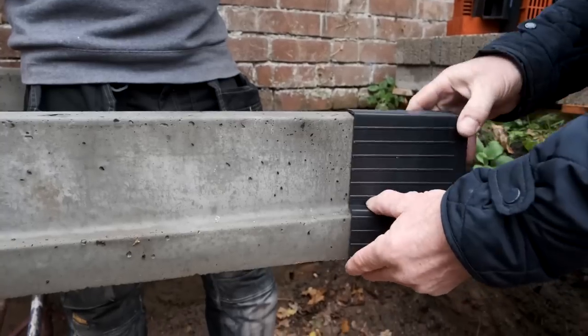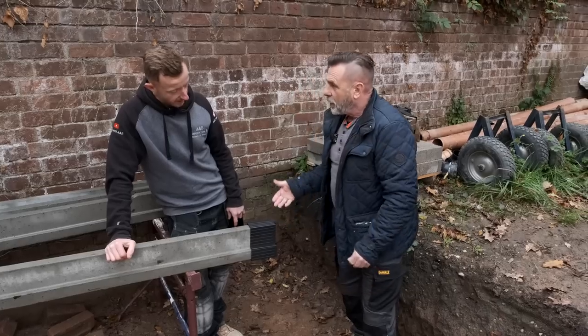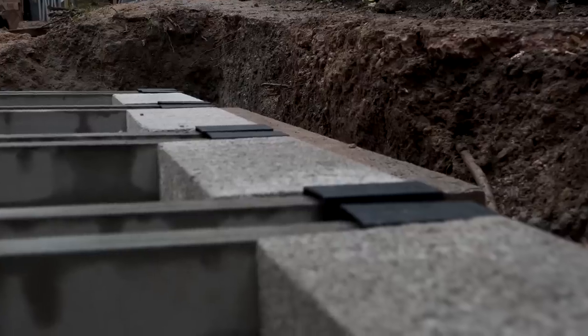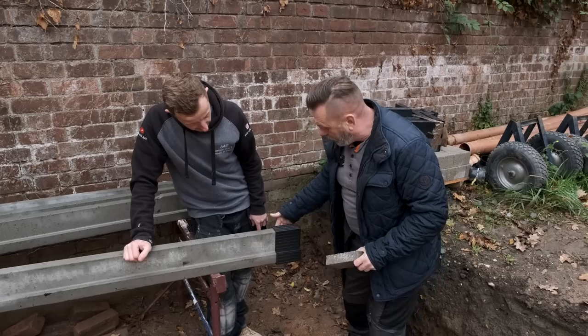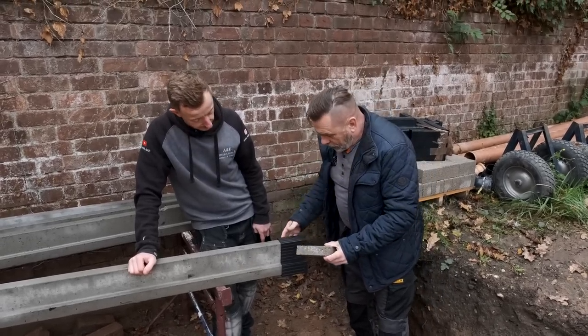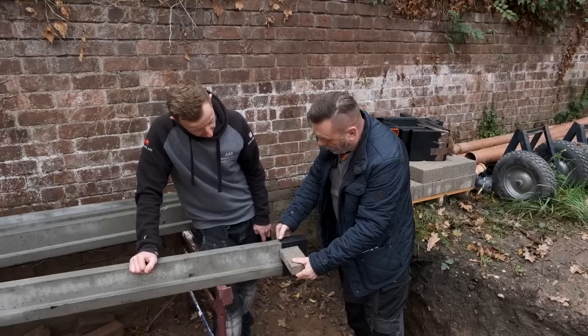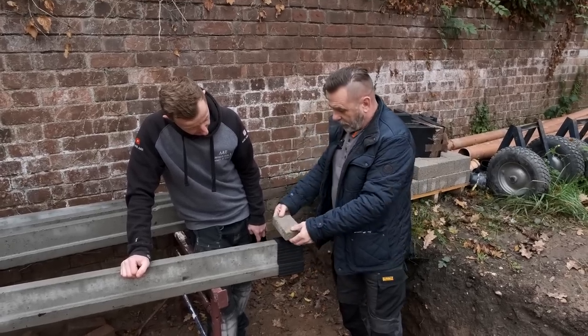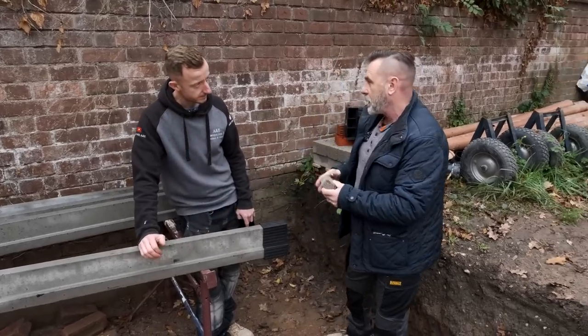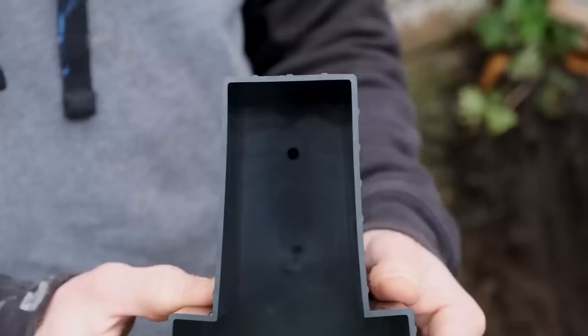With these it's a case of straight on - your slips sit in between and your block is ready to go in. They compress on this side because the recycled plastic is very soft and flexible. By the time they sit in they compress, and when you come to the top you've got your DPC line, your blocks sit on the top - everything's hidden.